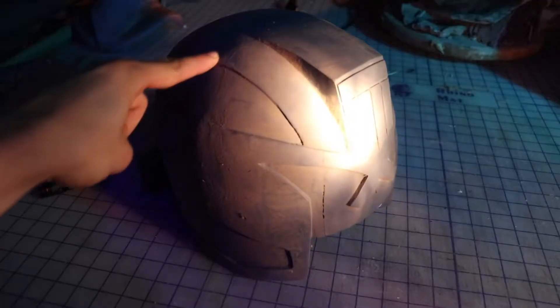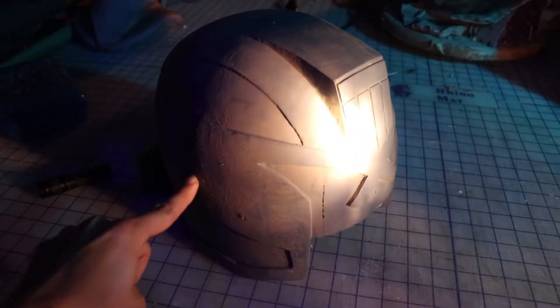Pro tip: when working on rigid molds and you want to find the perfect case line, you can do so by shining a flashlight along the side of the object you want to mold, then trace a line along where the shadow meets the light. For the kind of mold I'm working on, I shouldn't really need to do this. But if you're making a rigid stone mold of a face for a latex mask, for example, you want to find the best case line to avoid any undercuts that would typically happen around the ears.